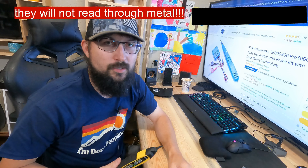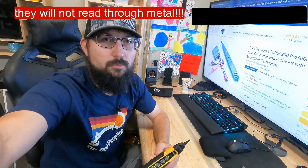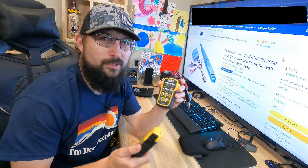It was about eight inches up from the box inside the conduit. I'm sitting there looking at the homeowner saying, 'Look, I wouldn't ask you this if I didn't have so much experience with these tone generators, but what this thing is telling me is that this wire is right here in this flex.' As unbelievable as that sounds, I convinced the homeowner to let me cut into that flex. I was even nervous cutting it myself, but I was confident with the toner. Long story short, we found the wire six or seven inches above the switch inside the raceway. It was a pretty cool feeling — almost like I had x-ray vision.